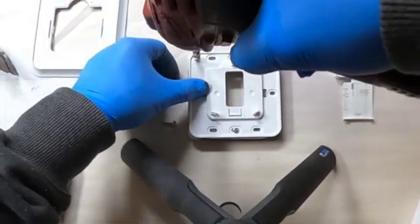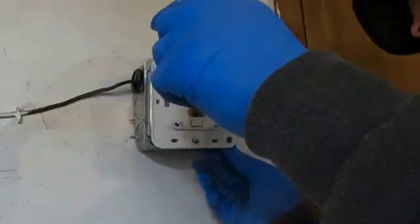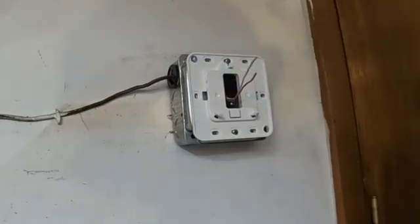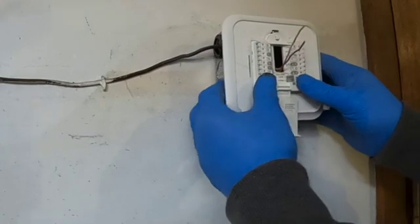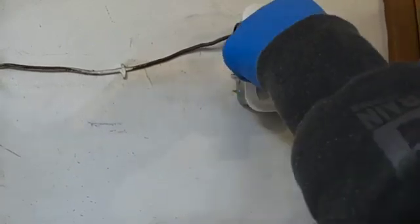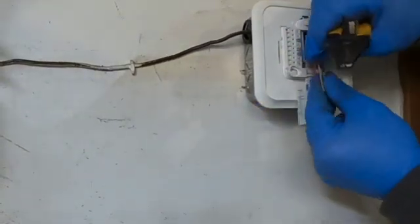I'm going to drill right through here. Now I can mount this and get access to my screws. Now I can mount the base cover plate — just like that. Then I mount the wiring connector; it hangs on the top and then I just push it down — snaps on like that. Then I can use this gauge to strip the wire. Just match that up just like this. Perfect. And then this one I can just match it up to the other wire.